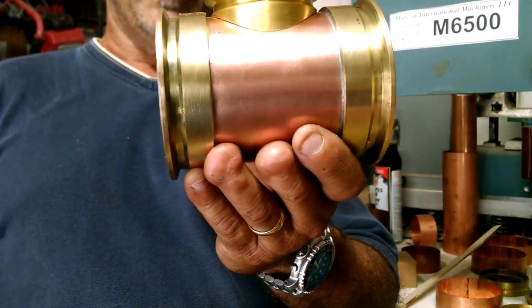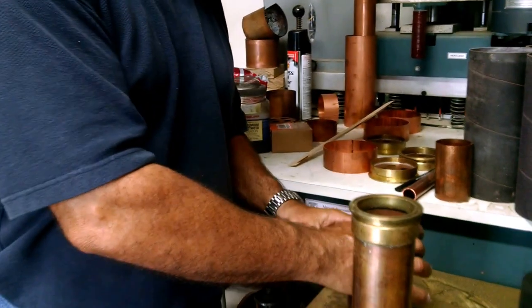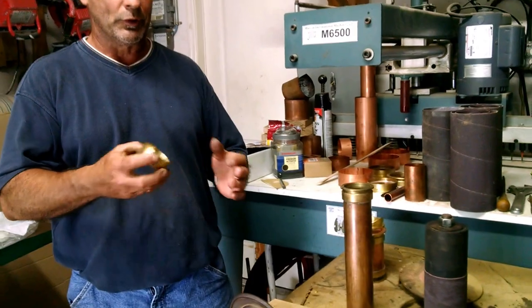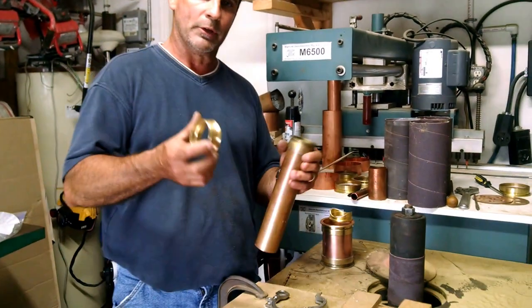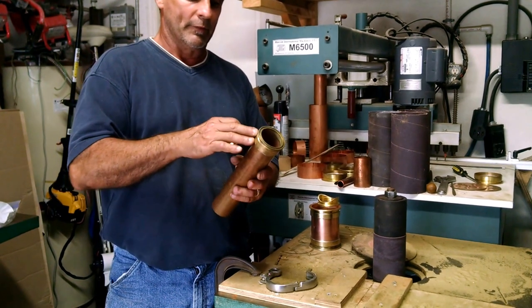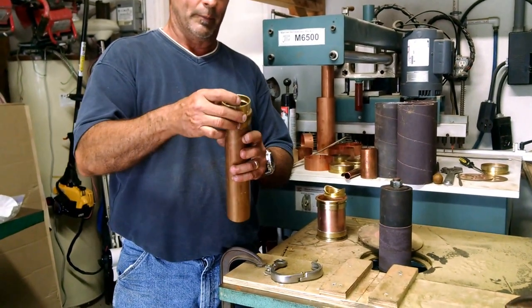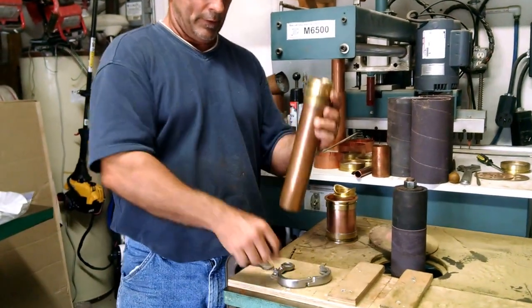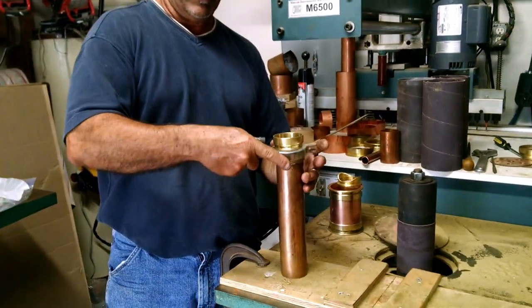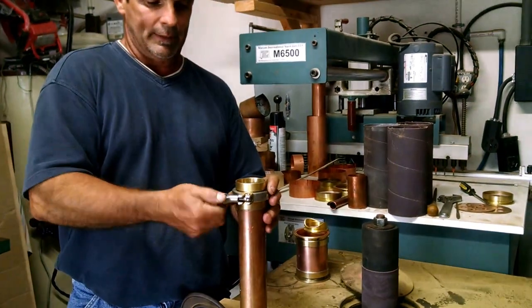So that's what we need to come up with and I'm going to show you how we do that. Typically what I do — there are a couple of ways you can do this, how you guys decide is up to you. I've actually taken a piece of two-inch copper pipe, soldered on a two-inch ferrule, so I can put another ferrule on there that I'm going to be doing the work on, and I'll just take a two-inch tri-clamp and stick it on there like this.